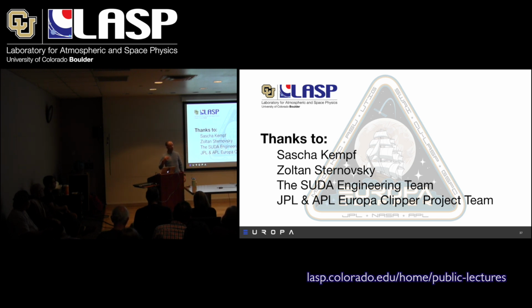And so we actually have watchdogs that watch for these things to happen and potentially decide, okay, we're actually gonna restart the instrument. We use a rad-hard non-volatile memory, a flash, or actually we use an MRAM that is rad-hard, that we keep the image for the FPGA in. And so anytime something happens with the FPGA, we just reprogram it.